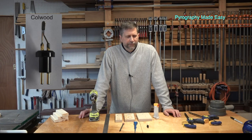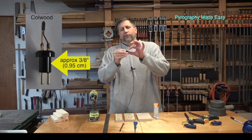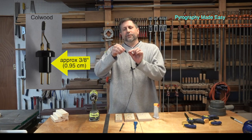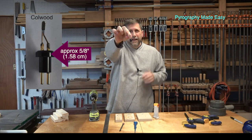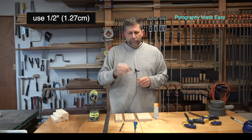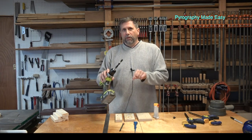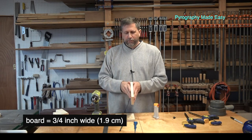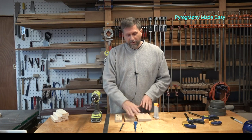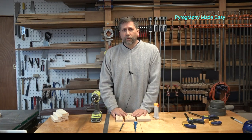You need to go by the pen nib itself — there's a certain distance here. The hole has to be big enough that you can put the nib down into it, but not so big that the flange part goes down in as well. You want to catch on the flange. For this nib, half an inch is just right. I'm using a brad-point bit because it helps guide right where you want to go. On a three-quarter inch board with a half-inch hole, you basically get an eighth of an inch on each side — not a lot, but doable. A drill press would make it a whole lot easier.